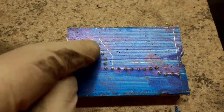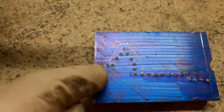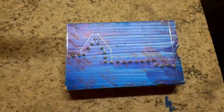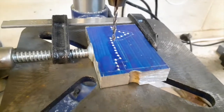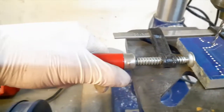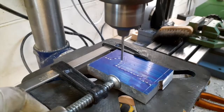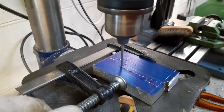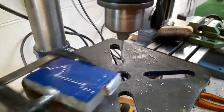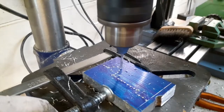Do the tracing in the metal and punch holes. These holes will serve to cut thick layers of metal. The holes will be drilled so you can cut thick metal without too much effort if you don't have a band saw or another suitable machine. Just drill first in the corners — this is aluminum so it's soft. I start from the corners, then drill all the other holes.